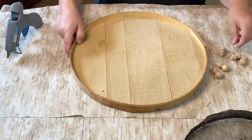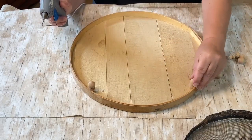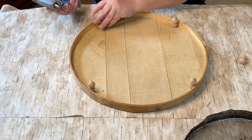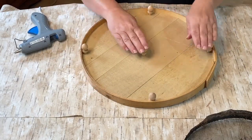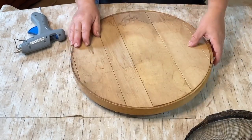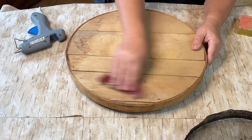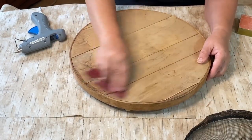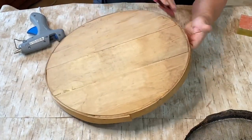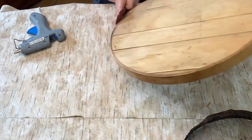Here is the bottom of my cloche. I've got some little wooden pegs and I'm going to use those as feet — putting four around the outside edge and then one in the middle, because it's so big it pushes down in the middle, so I wanted it to stand up really well. Then I flipped it over to check it for level. I took my sandpaper — I think this is 60 grit — and went over it a little bit because there's a water stain on top and I wanted to smooth it out and get rid of that.